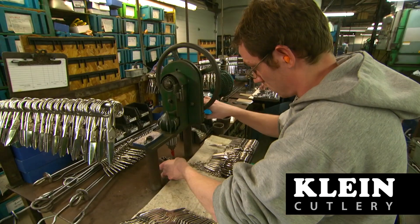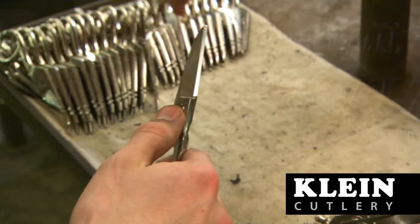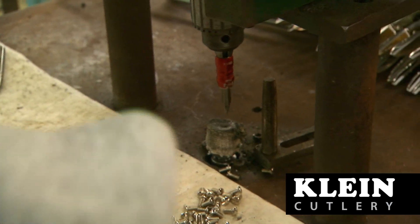After dipping the handles and curing them in a baking oven, the coated top and bottom blades are assembled using a proprietary tri-lobular screw, which is tightened to a predetermined torque value. These self-locking screws keep the two blades tightly together for consistently smooth cuts.